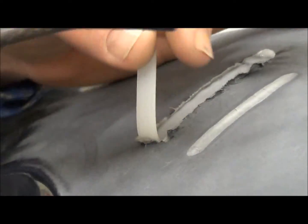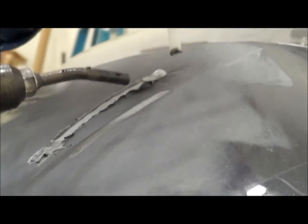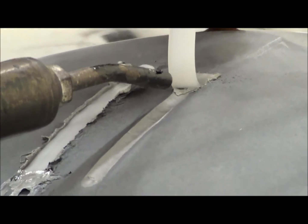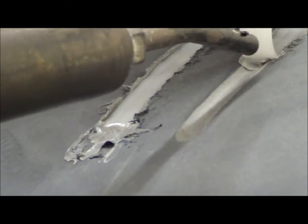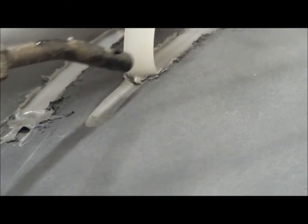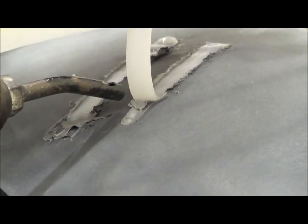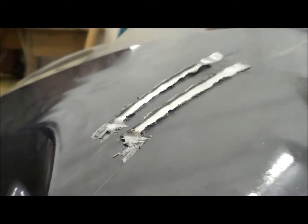When I get to the end of that weld, I take the back side of my welder and just pinch it off. I'm going to run another one so you can see — right back here I'm beginning to show a little bubble there in front of it. Sometimes it may show up a different color, but usually it'll show up kind of clear looking. In this case if the bumper is melting into the rod so fast it's showing up the same color as the bumper, that's great. This is an old Nissan bumper — they're polypropylene but they've got two other mixes in them. We have now performed two welds.